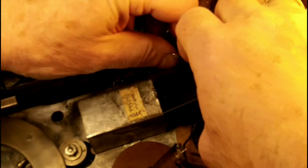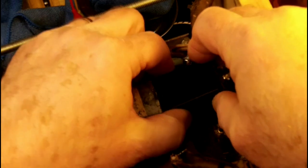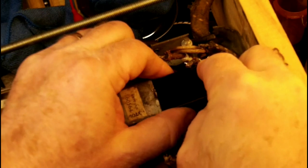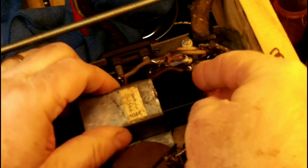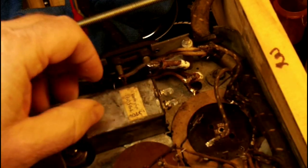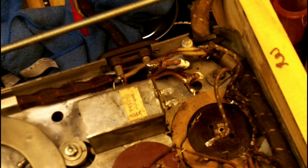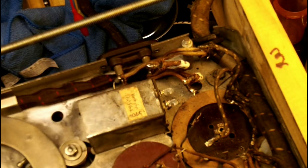I got these three terminals all soldered on here. I left this pretty flush to the bottom so that I have room to cram it in the can, and I'll take this last leg and solder it to the lead that's coming out of that can — that's the ground. I took that tail sticking out from one capacitor as well as the flexible lead from the can and got them soldered together in back. I pushed that little clump into one of the holes — that's why I recessed the caps back far enough to have room. Now I'm ready to see if I can get this thing squished back inside. I did my dimensions right so it should go. It's in — perfect! Now all I have to do is push the tabs back over that cap and we're done.